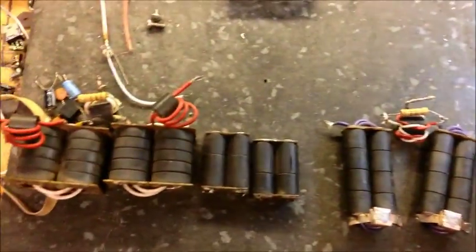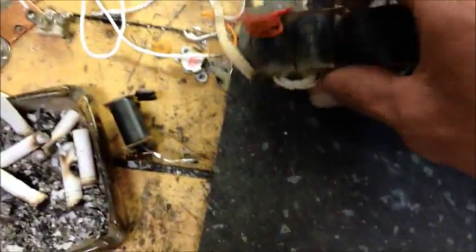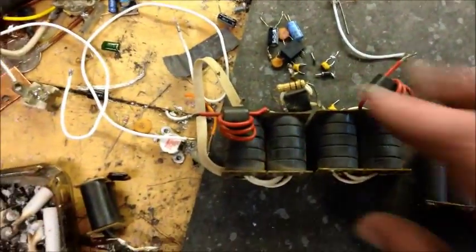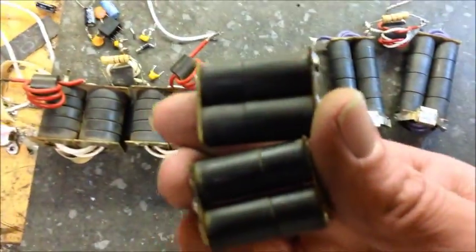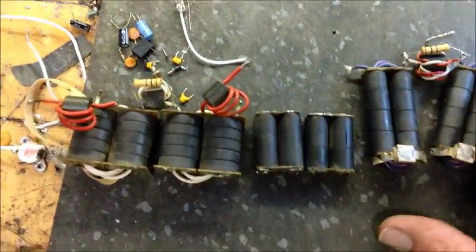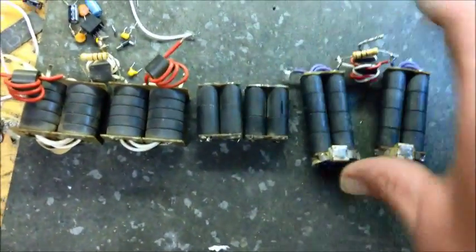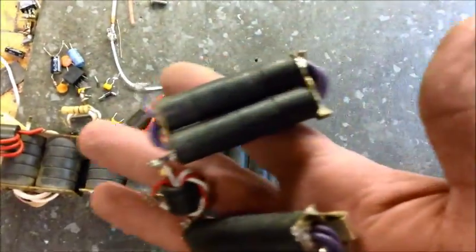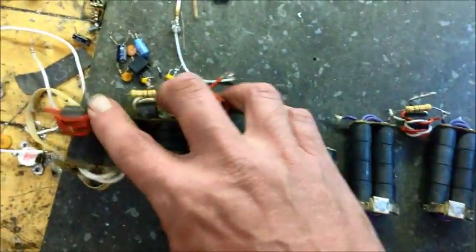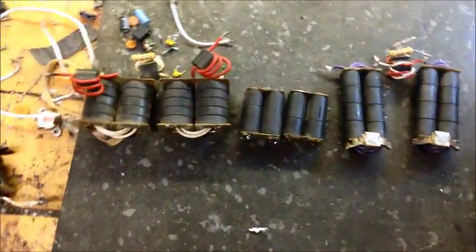Most of these are pretty much similar to the same ferrite. Now when I got into the other ones I'm going to change out — I'm not going to tell you what ferrite I'm using, because these are ones I make here in the shop. But basically I got a set out of a Dave-made X-Force or something I pulled apart. I'm pretty sure they used 61 ferrite, so we're going to go with those. I have a set of inch and a quarter, half-inch bead 61 sitting here. I also got these out of another amp — I'm pretty sure after looking it over these are 61s also. When I did an inductance test, I had eight of these I took out of a guy's amp, and when we did the inductance test they pretty much measured out as 61. So to be fair, instead of the mix I use in my amps most of the time, we're going to start off with mine first and then do the various different rebuilds with these different transformers.